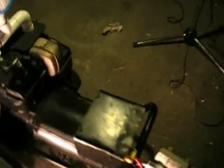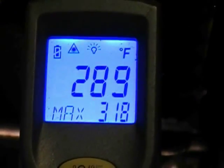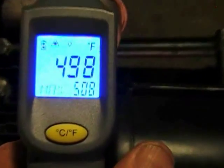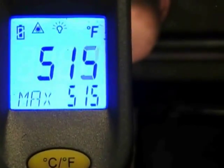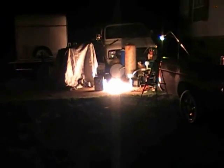Let's take some temperature measurements. Just like with the wood gas, the cylinder head was at a lower temperature and naturally the exhaust was at a higher temperature. My main reason for doing this tonight was to get a baseline reading using propane gas. I already knew where it stood with gasoline, and the propane is pretty close to gasoline as far as how well the generator runs under load.